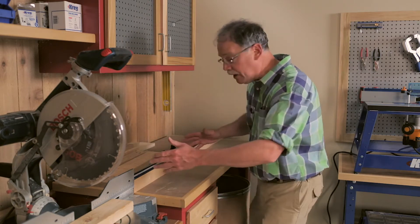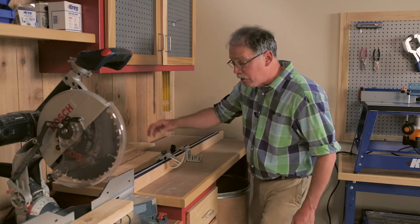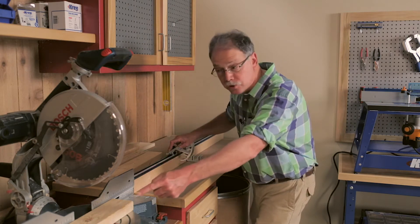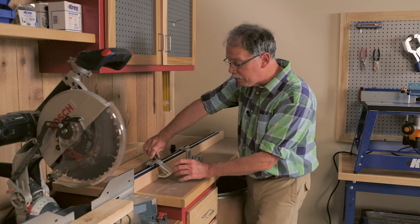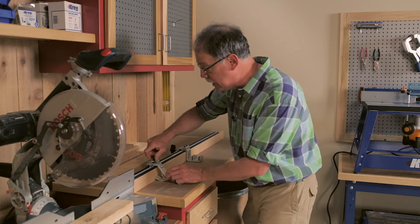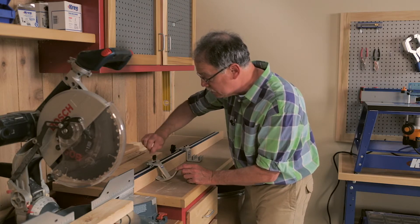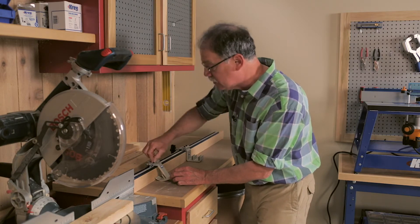When you buy this precision system, you get four two-foot sections of this blue extrusion. This is metal, and it allows you to put a scale system on top, index it off your saw blade cut, and then use either a swing stop to swing it into position exactly on the mark for whatever length you need. There's a clear cursor on this that you can micro-adjust by releasing this screw or bolt here ever so slightly, adjust it after you do a test cut to match the length of the test cut, then tighten that down.